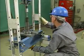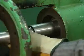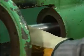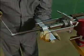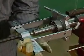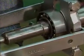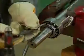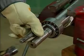Rolling contact bearings are usually installed with a press fit on one ring and a push fit on the other. Removing a bearing installed with a push fit is relatively simple because it is a loose fit. Removing a bearing installed on a shaft with a press fit is more difficult because it is a tight fit. The principles involved are the same whether it is the outer ring or the inner ring that has the press fit. In this part, we'll look at two methods for removing the press fit inner ring of a bearing from a shaft.